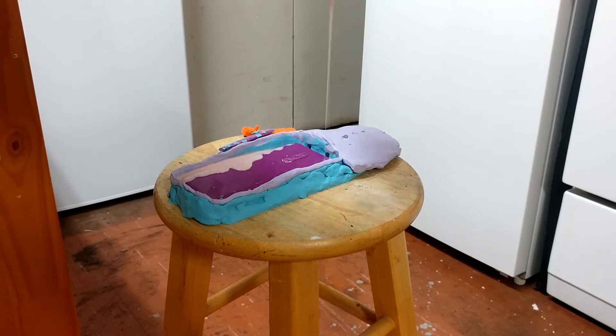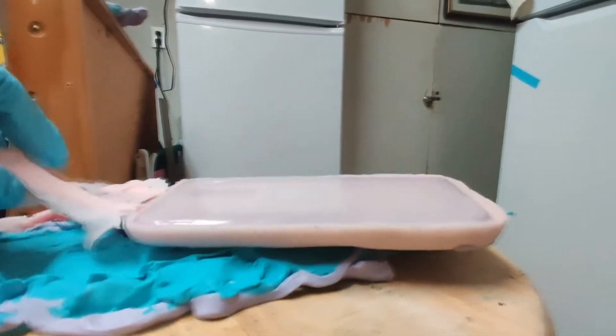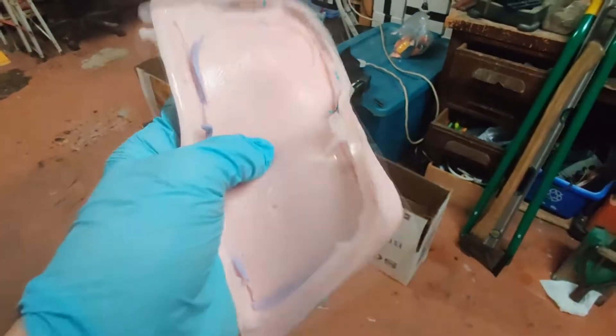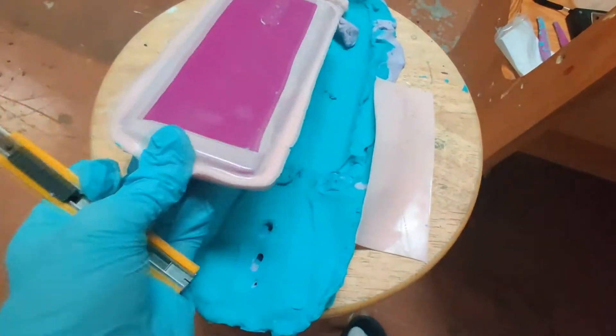And this was what awaited me in the morning. For starters, the place that I was casting everything wasn't level, so the liquid silicone shifted unevenly around the mold. I also needed to make about two and a half times the amount of rubber I originally thought. And lastly, the rubber just wasn't sturdy enough to hold the flimsy ears upright. And because the dummy phone was made out of plastic, it floated in the liquid silicone rubber, ruining the mold anyways. So I have to think of something else.